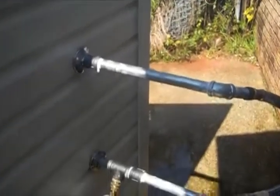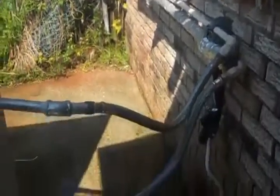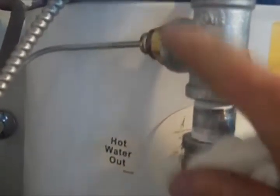I made the final connections this morning that connect the solar water heater to the house. All I've got to do now is add water. I've completed the connections going to the tank on the inside — got them going through their own hole now instead of the dryer vent. The valves are kind of in an awkward position, but I reused the ones I had rather than buy new ones. Once it's already glued together, I just have to work with what I got. The plumbing is connected in the exact same configuration as the old design; the pipes are just going out a different hole now. That's the temperature sensor that monitors the hot water going into the house, and there's where the hot water goes into the house.